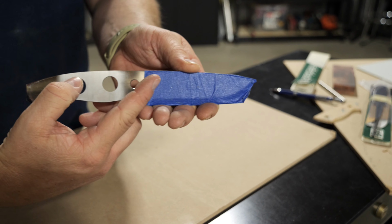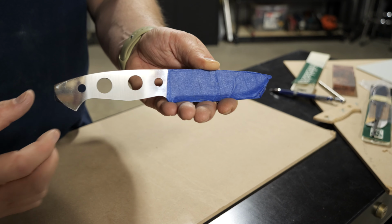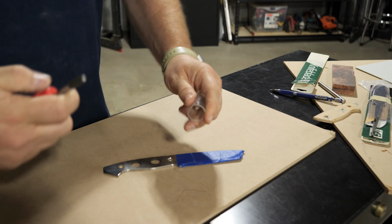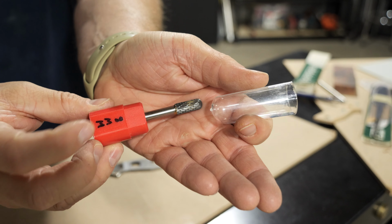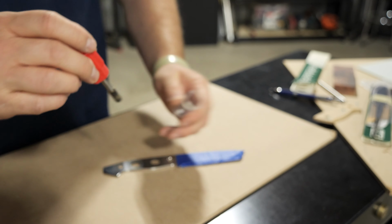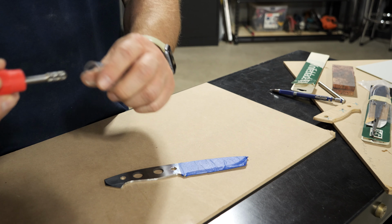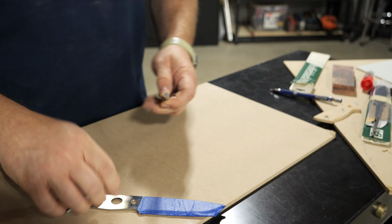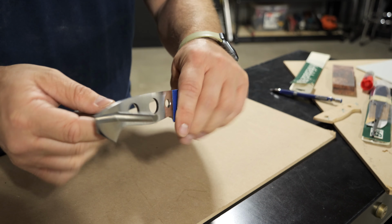Then I've gone ahead and bored out the two pinholes here to a standard size. I used a double burr bit that I got online. I have a whole set. This is an 8mm. I wrote it on there so I could refer to it. I basically just used drill oil and tapped this out to a standard 8mm bit, and I'll be using a stainless steel pin, no design or anything for this one.